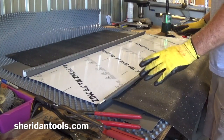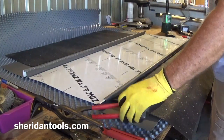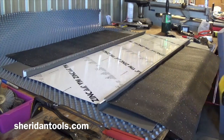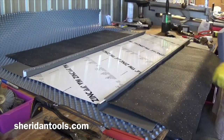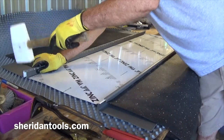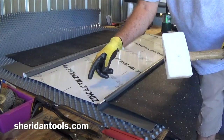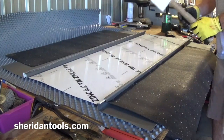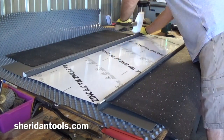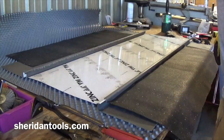We're in a situation now where we have to save everything, so everything gets protected everywhere throughout the folding process. All right. So I want to make sure that this seam is as close to flat. I want this part here down, so that when I put my seaming tools on there, all my seaming tools work. All right? So just take a minute. Make sure that's fitting pretty good. That's pretty good. And then begin the reseaming process.